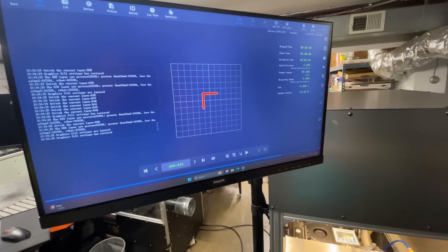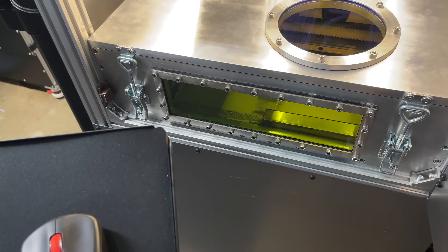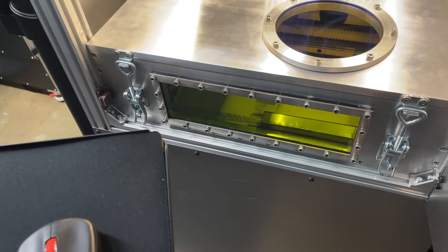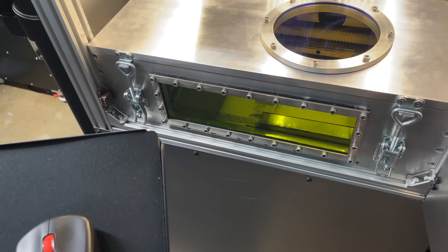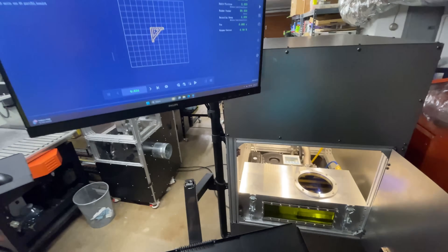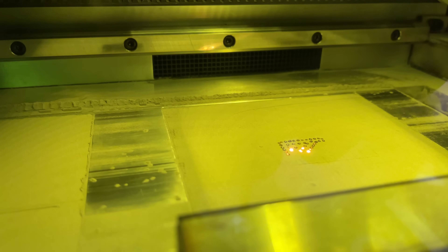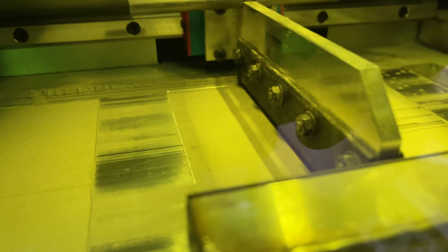I'm really not sure where to start with the parameters — I'm just relying on ChatGPT, so who knows if it's giving me good or bad info. One other thing I'm not sure about is where to position the printing bed at the start of the print: do I want it set at zero so it's flat, or down lower so it already has the first layer covered with powder? We're down to 0.9% oxygen, files loaded, I think we're ready to go. It looks like those didn't adhere to the build plate at all. Maybe the answer is I need to start with the build plate at zero — that time I started it with the layer already covered. I stopped the print and I'm going to try to get a better first layer before letting it run.